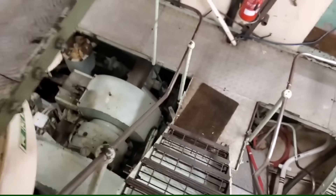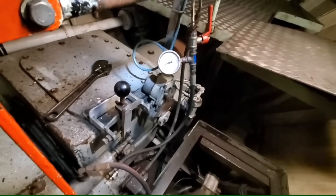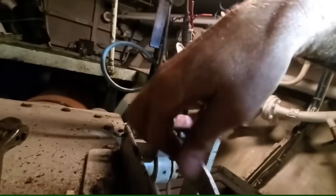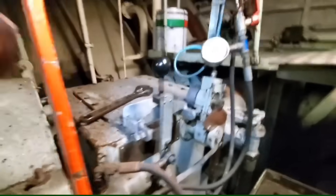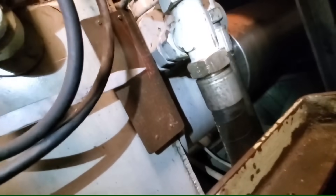Accessing memories of the CPP system — I'll leave the full story for a different video. Here I'm going down to the OD box — the oil distribution box. There's the control air valve I just turned on, which was off. I'm also unlocking the lever which actually actuates the oil distribution valve — it's mechanically locked, so I'm just unlocking that. Now I'm able to manipulate it. You can see the indicator showing which pitch — forward or astern — the CPP is at. Now I've unlocked it, heading back up to the ECR.